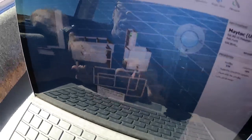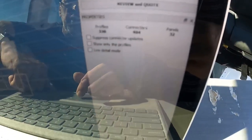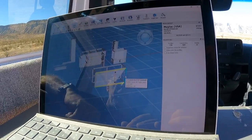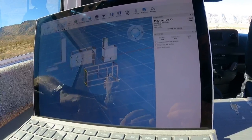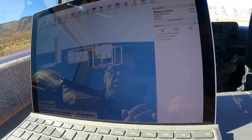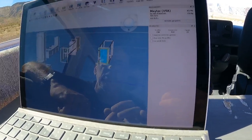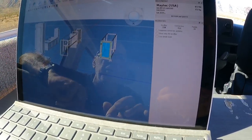You can make whatever you want using all the different pieces of 80/20. It then comes out and tells you how many connectors you need, how many profiles — those are individual cuts that will be made — and number of panels. You can come in and say, for instance, I want a door right here, and it'll go ahead and create the door, showing the dimensions of those cuts. It puts a latch in and puts the hinges in — all of that is inside this program.